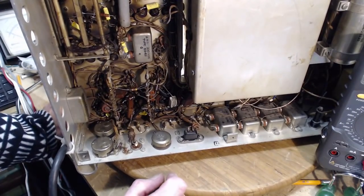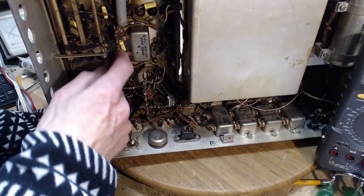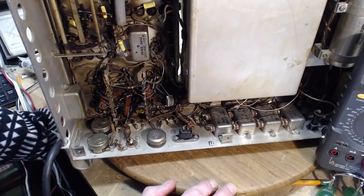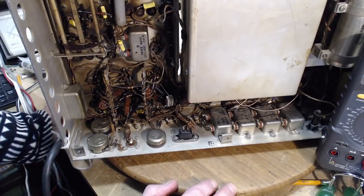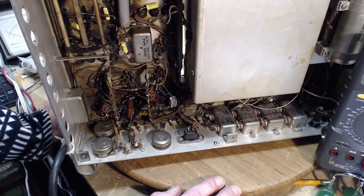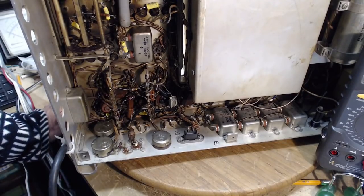Yeah, see, I wasn't doing this on camera because I hadn't started. I did this work, just the capacitors, just before I started doing YouTube videos. Should probably cut all that out and put in one resistor. I'd have to find that on the schematic and verify it. So the problem here is we're supposed to read 46, but we get nothing. And that's on pin number 6.